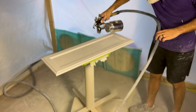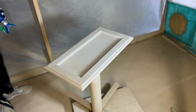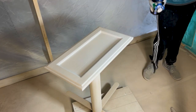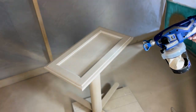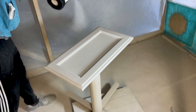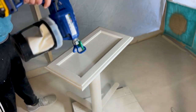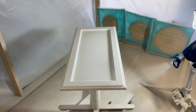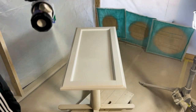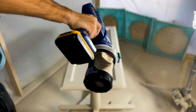This is probably my final coat of primer. After finishing that I moved on to hand sanding, then I used the Graco Ultimate Handheld with Divine White Sherwin-Williams Emerald Urethane in semi-gloss and a 210 tip. Make sure the cup is on tight — if this gun loses suction it starts to spray poorly. I also recommend you start and stop off the workpiece, because the little guns tend to spit, so starting and stopping off the workpiece is best.